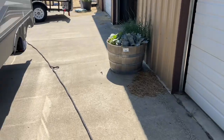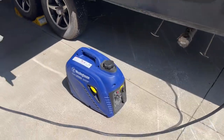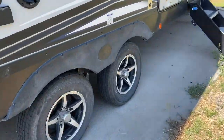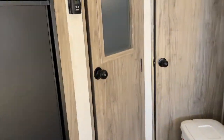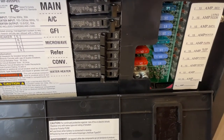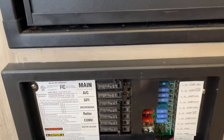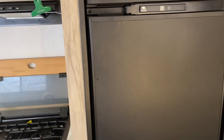It's really hard to use 20-amp service and get that air conditioner to run. You can do it with the iGen — you almost have to trick it. If the density altitude is any higher than 5,500 it's probably not going to work. Remember that density altitude can go down if it's cooler, for instance in the mountains. One of the key things — and this is not a how-to video, just how I do it — is turning off all the breakers. The only ones I have on are AC and main. The fridge will rob 400 watts and the converter charging the battery will also use at least another 400.